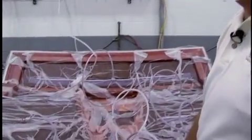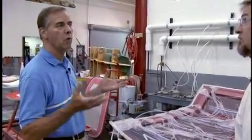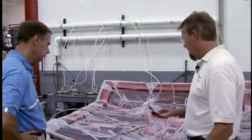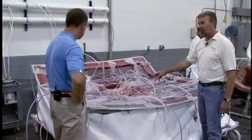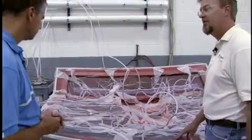This is the actual cap that goes over top of it. That's great news for those concerned about vertical center of gravity — keeping the weight down the higher you are. This part is gel-coated first, then we load dry glass into it. You can see we've got PVC coring material in it — we actually have two different types of coring in this part. This material here is carbon fiber. We use that over the front to hold the shape once it's mounted on the boat. It's a unidirectional carbon fiber laid crossways — it holds the crown better than braces we've had in the past.